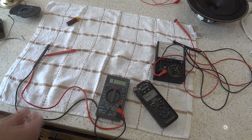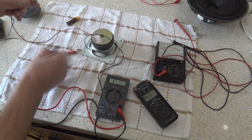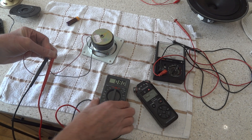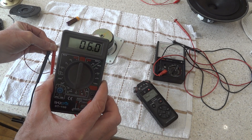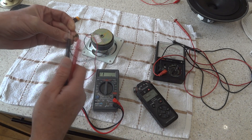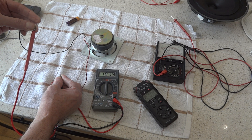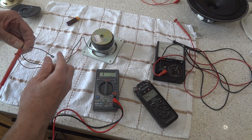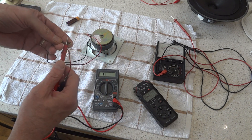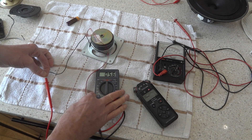So that's the bass driver. We're going to go on to a mid-range now. Just connecting the meter to both terminals — doesn't matter which one is which — and we should get a reading. It's reading about 6.2 ohms, fluctuating a little bit because I'm holding it and the contacts are a bit dirty. I'm trying to hold a good connection — 5.6 ohms. When I put a good grip on it and hold it steady, it stays stable at 5.6 ohms.